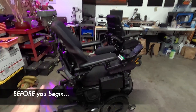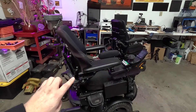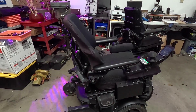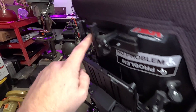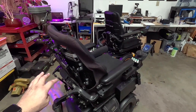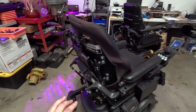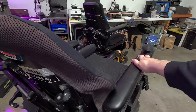A few things here. Before you start auto calibration, you have to make sure nobody is sitting in the chair — that is very important. Also, you need to make sure that there are no backpacks or things hanging off the back of the chair. In the case of this chair, I actually have to remove part of the backrest because this headrest mount right here will interfere if I tilt too far back. This auto calibration is going to run most of the actuators to their full extension. It doesn't always run all of them fully, but there is a chance it's going to run them in a way that will cause this to crash.